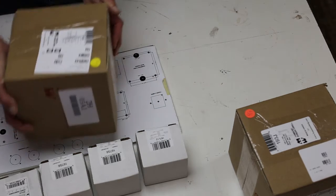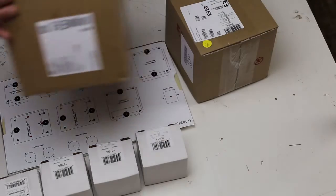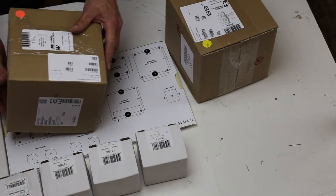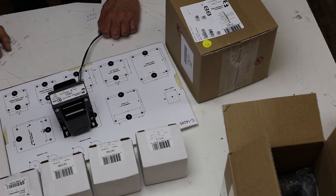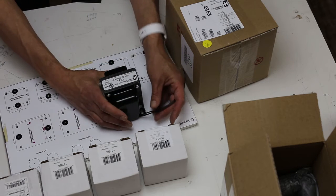Next up we have the big 274BX, and this works pretty well. It warms up with the project but within tolerance. Then you have the Hammond 193J — Hammond makes some great transformers. It's kind of like a Ford truck: they're reliable, they just do what they're supposed to do and they ain't too fancy about it. If you want a Porsche, go talk to Souders — but get your wallet out. He makes some of the best transformers in the world, but that's up to your budget. The Hammond 193J is a 10 Henry 200 milliamp reactor choke and will be for the high voltage.